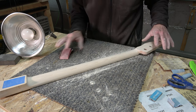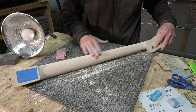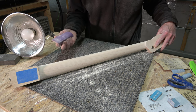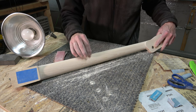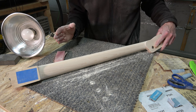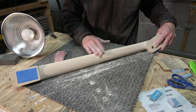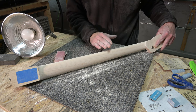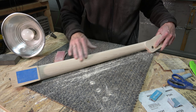The thing about this process is I'm starting out with 220 grit, which is going to leave a really smooth surface. However, I can still see sanding scratches from 220 grit if I look at the surface closely, and if I were to put a stain or oil on this neck those scratches would stand out. To take it to the next level, I know I'm going to have to go up to about 400 grit, possibly even 600 grit. I may even wet sand my oil finish into the neck — and by doing that, this wood is going to look perfect, with no sanding scratches at all left in the surface.